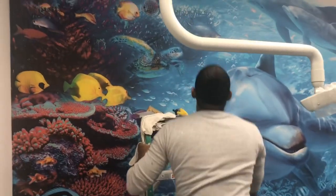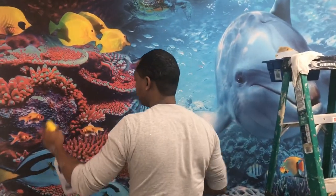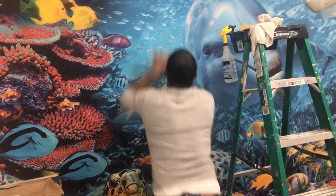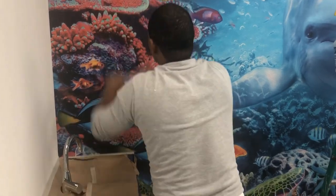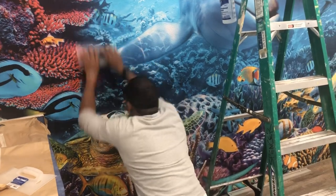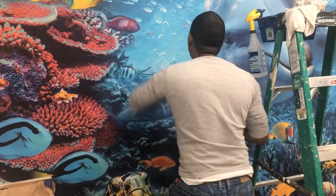During this time, we remove any residual glue that might be on our wall cover, and we remove the smaller bubbles that are now paste bubbles. They're no longer air pockets per se, they're simply small paste bubbles that are about the size of a United States nickel or smaller. And see how we're moving it out aggressively? Two hands on the transparent smoother, and we pull it down, and this really has proven for me to be an excellent manner of removing both air and a disproportionate layer of substrate paste.